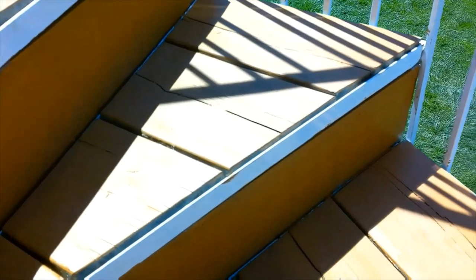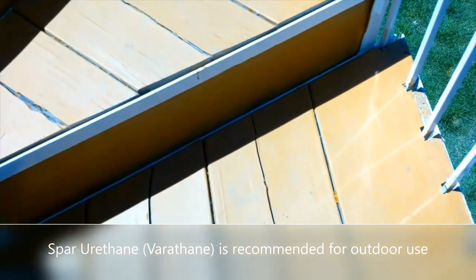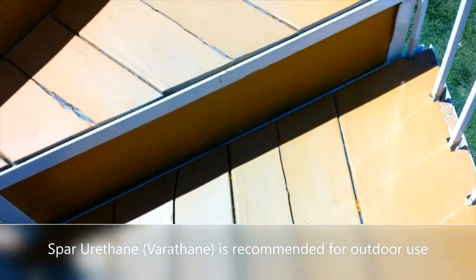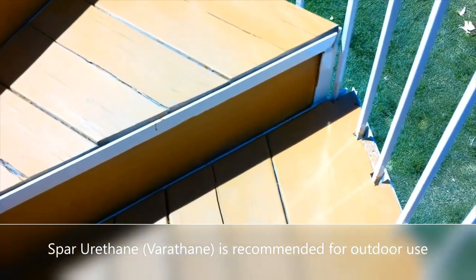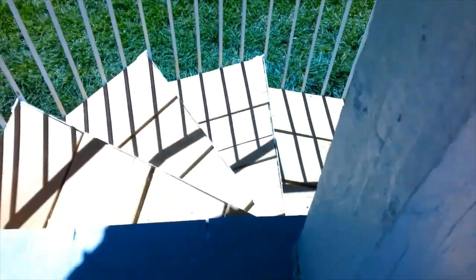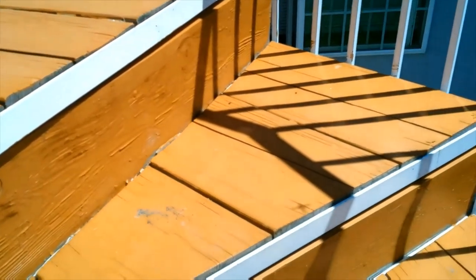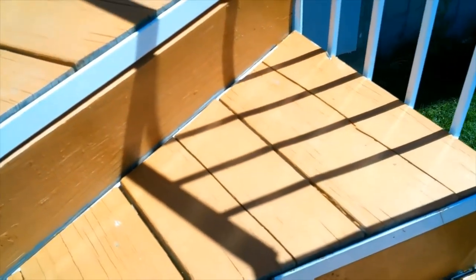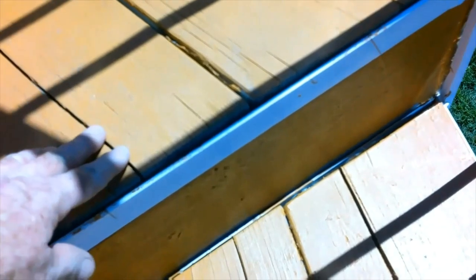The stair treads were made out of 2x8 dimensional lumber, stained with golden oak stain and varathane. Unfortunately I did not know that varathane is not good for outdoors — if I had used spar varathane that would have been much better. Because I used the wrong varathane the finish did not last very long, and the rain and sprinklers destroyed the finish over time. So I had to find a paint that came close to the golden oak color, and that's what's painted on there now, which still looks pretty good. Each year I find myself gluing down boards that become loose from the previous winter. Because the original finish allowed some boards to warp and eventually crack.